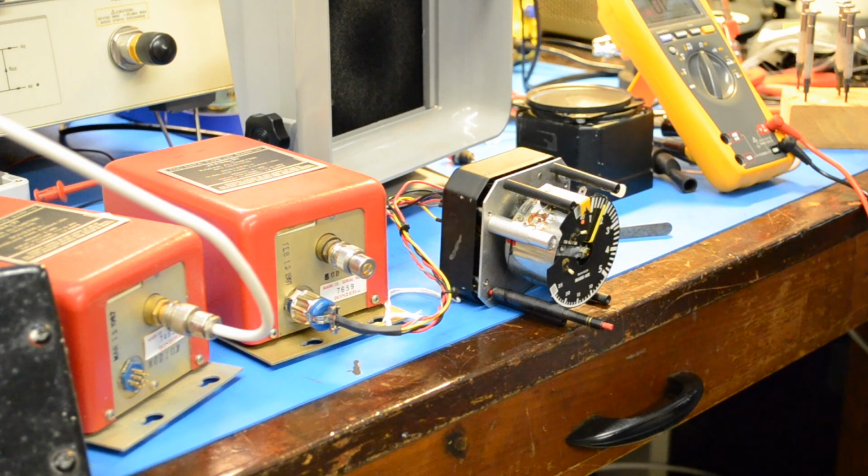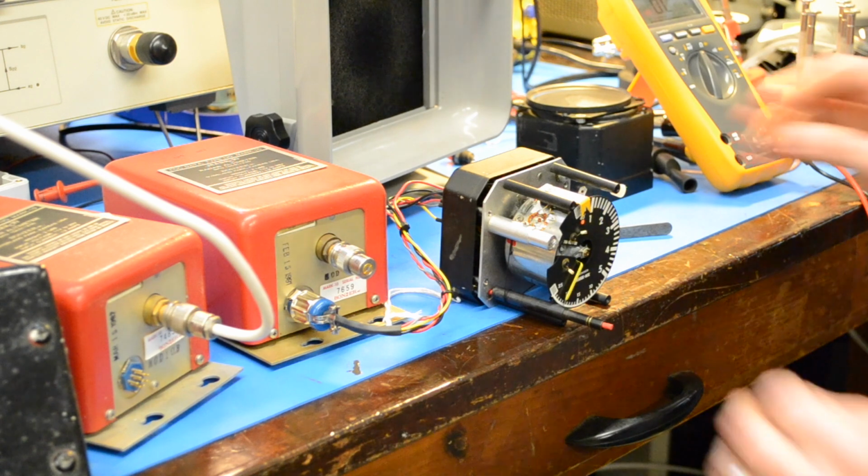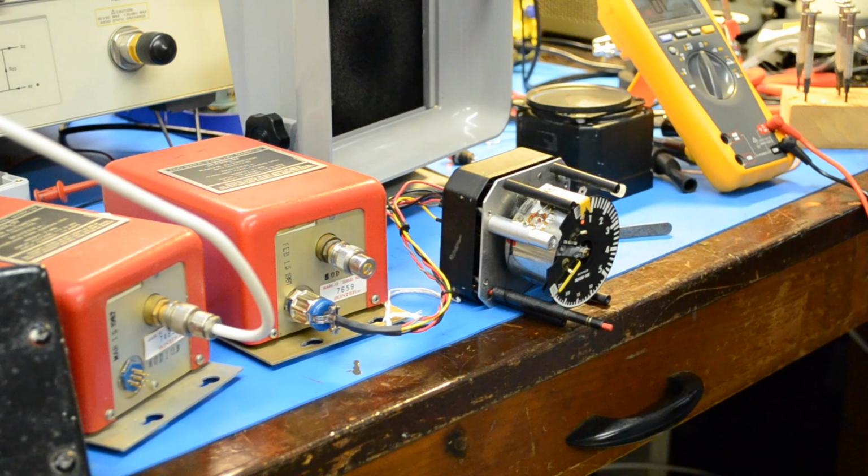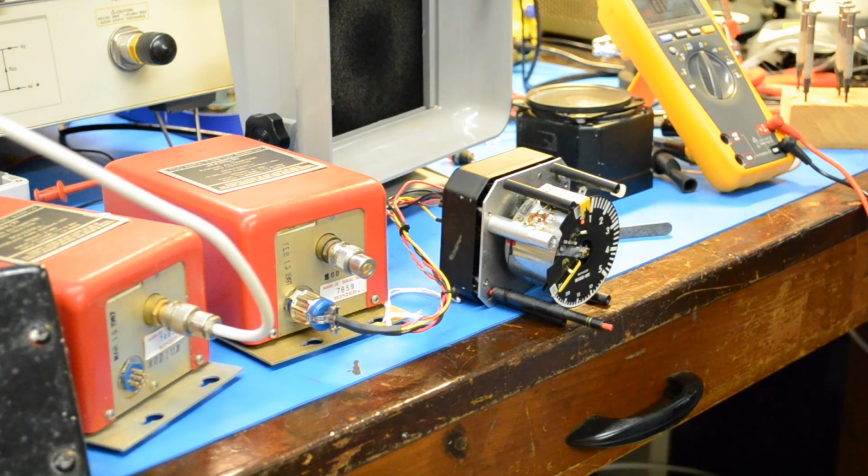and we give it a minute to warm up, or whatever it's doing, you'll see that it'll think that we're at maximum altitude, 2,500 feet. After a minute or so, it just kicks all the way to the top, because there's no signal, so there it goes. So it assumes if there's no signal that we're at the maximum altitude, which is pretty cool.